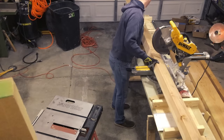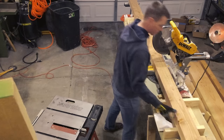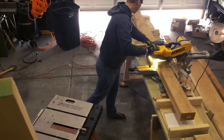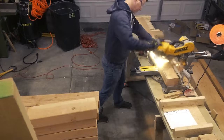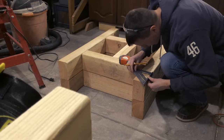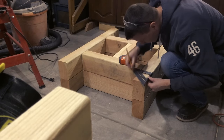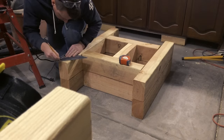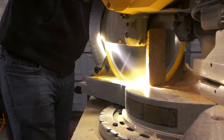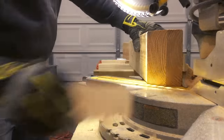Now it's time to get started out in the shop. The first thing I'm going to do is use my miter saw to make all of the cuts on the cut list. I'm starting with the 4x6 pieces, and then I'll move on to the 4x4 and the 2x4's. Once I had all the pieces cut, I laid them out on the floor in just the same shape they would be once the legs were assembled. I then took a speed square and marked my 2-inch corners that I was going to cut off the ends of the top and bottom piece of each foot, took those back to the miter saw, and cut them off.